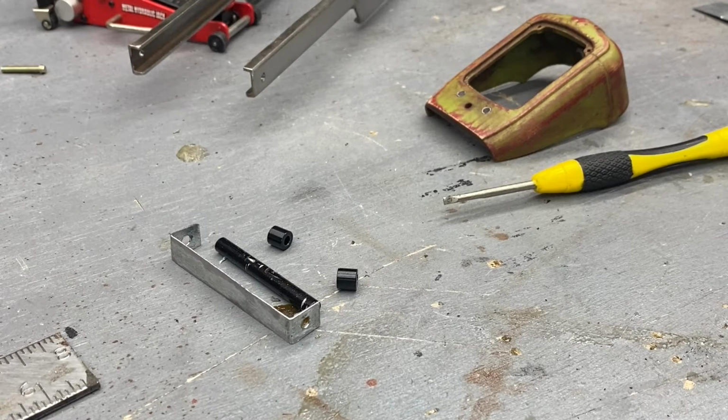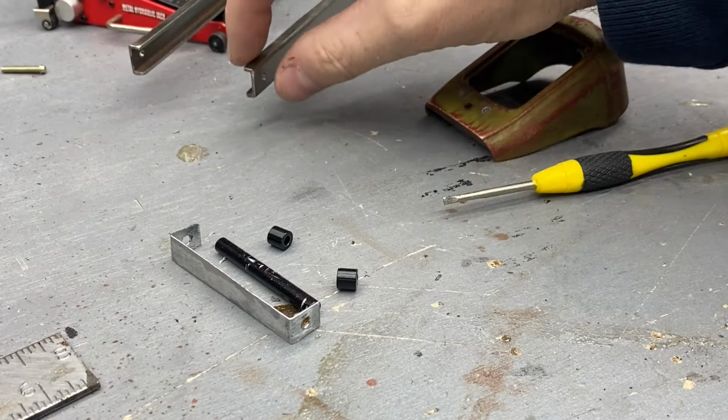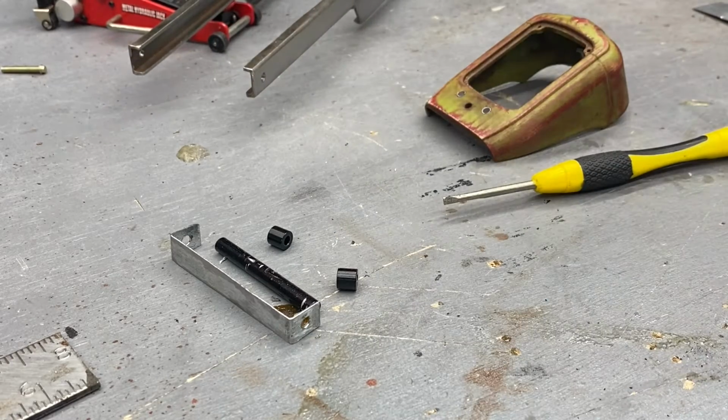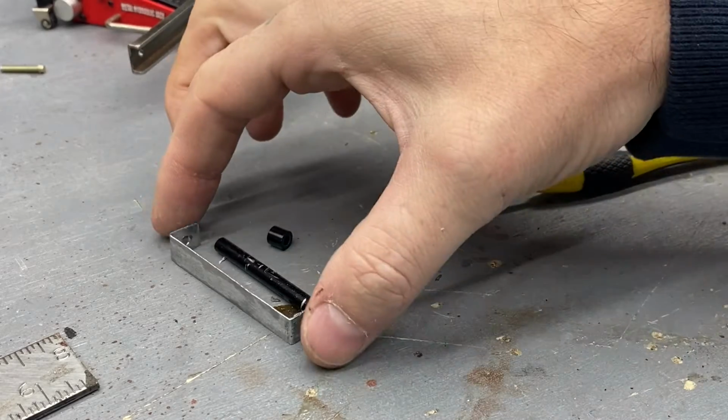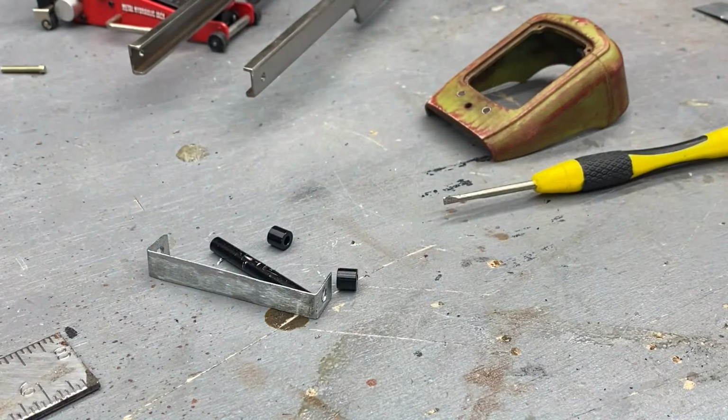When you think in terms of steel tubing like this, C-channels are super rigid because they have 3 sides and it's all one piece. Adds a whole lot of strength to it. This is not going to have that. So it's going to be squeezed and bulged out just a hair. And then we will have to do some kind of layering on that.